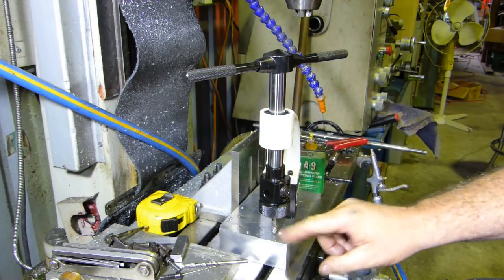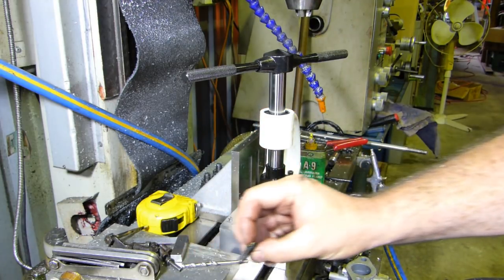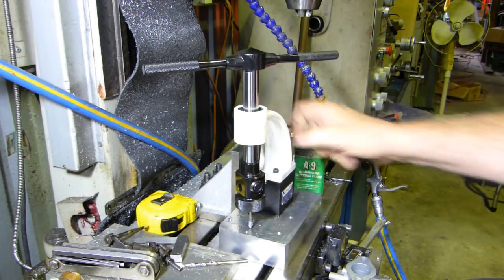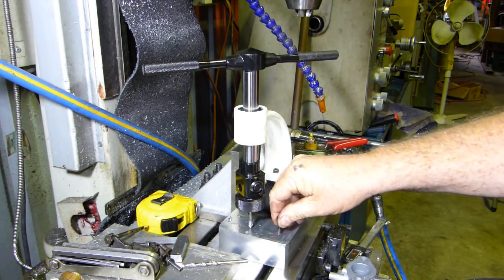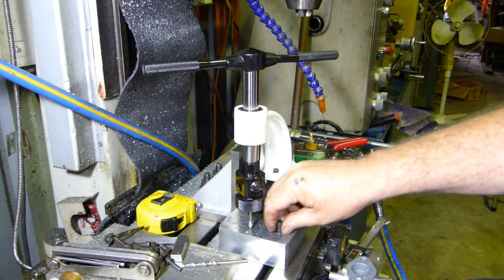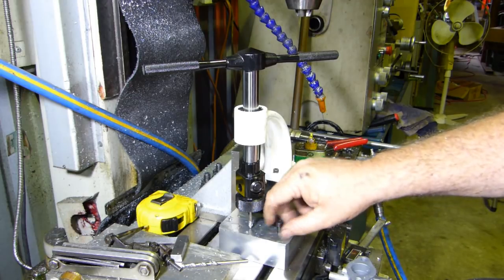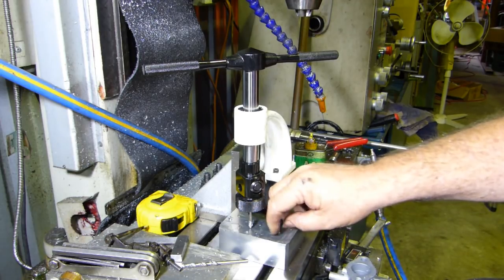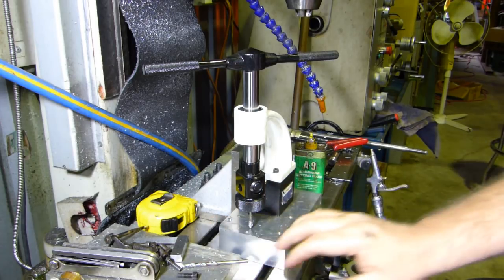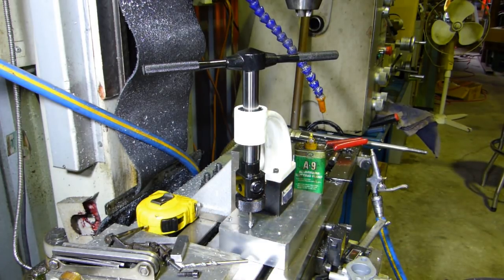Right, so that's the taper tap. Gotta check that the thread's going to work. That aluminium magnet doesn't hold on very well, does it? That'll be fine. We'll actually run down with a bottoming tap. So I'll tap all these and then we'll come back.